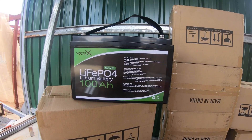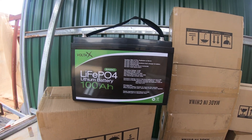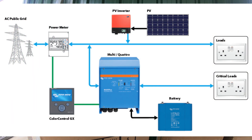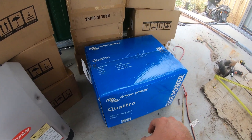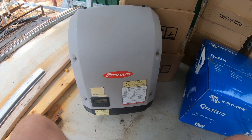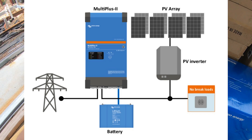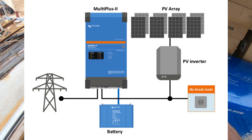In the meanwhile I've been doing some research about other alternative methods to charge things. Victron supports a whole bunch of things. You can have inverters that are just your normal PV inverters — non-islanding inverters — and you can run them out of band and use a meter, and this will charge batteries based on what it sees your house inverter producing power at. We bought this thing second-hand out of Gumtree. It was 150 bucks. It's not the recommended version — it's a Galvo, a 3 kilowatt Galvo — but it does support zero grid feeding.